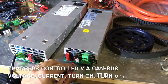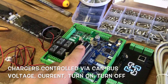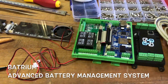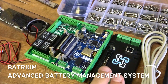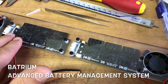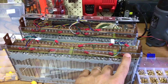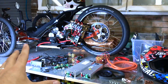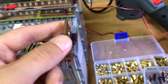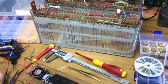They're all controlled by CAN bus — they need something like a little computer sending commands to start charging and stop charging. So it's a bit trickier, but the battery system can handle stuff like that. These are the balancing boards that actually do the balancing. This is the battery that's gonna go on my trike — really thick pure copper. No BS here. There's active air cooling — it's gonna be epic.